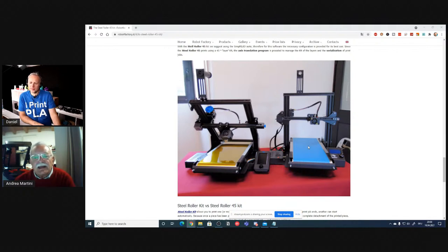It's the same technology with the roller, but two different versions. One is 19 degree, and the other is 45 degree. The 19 degree is possible to print a lot of pieces, but the printer starts, prints one piece, then ejects the piece, goes back, and starts again. And with 45 degree, it's possible to print endlessly, without stop, in a continuous manner.